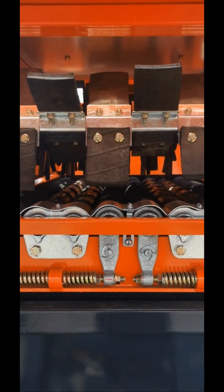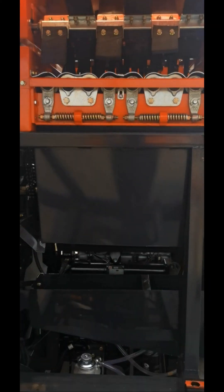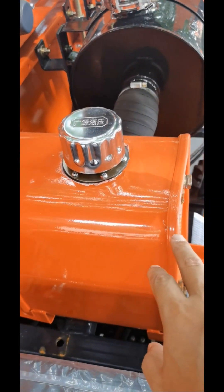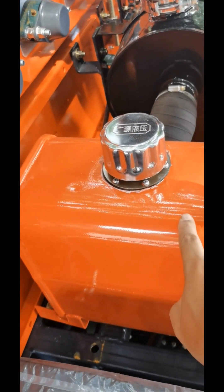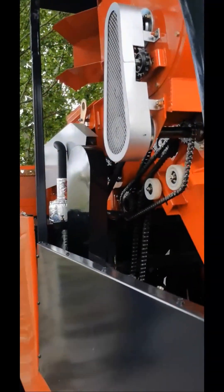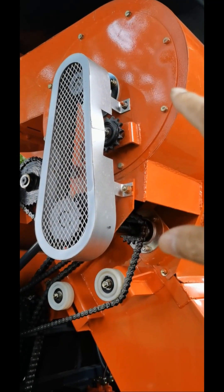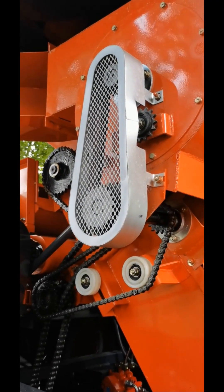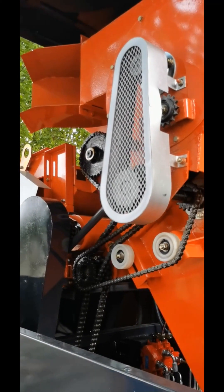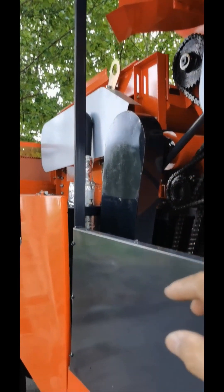Here is another side of the feeding system, which belongs to the corn tank side. This is the hydraulic oil system with the hydraulic oil in this small tank. And this is the powerful fan system — before we didn't have this system, but now it is a new part. Because of this fan, more dust and more peeling covers will be blown out, so the corn tank will be cleaner and the corn seed will be more clean.